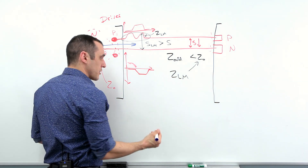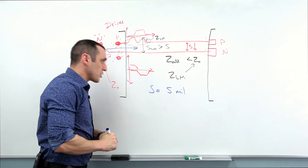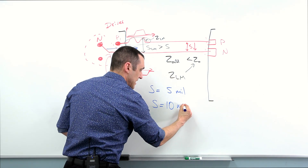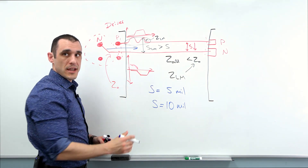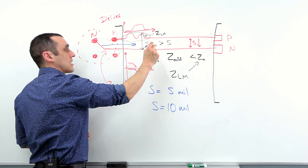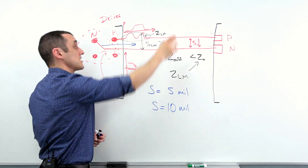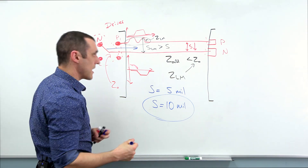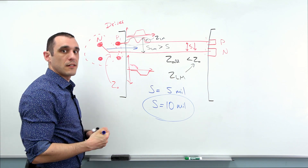This is another motivator for making S a little bit bigger than the default value your routing tool applies. If you're an Altium designer, the default value is S equals 5 mil — that's a pretty small value. What I actually prefer and have been doing more often lately is to set S equal to 10 mils and bring the ground plane closer to these two traces. By doing that, the coupling that determines the impedance of the trace is more strongly determined by the ground plane instead of by the other trace. I prefer slightly bigger spacing, but not too big — because going too big means you lose some of the radiated noise cancellation benefits of differential pairs.